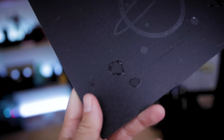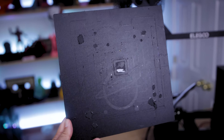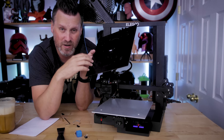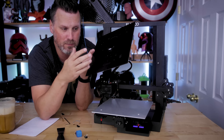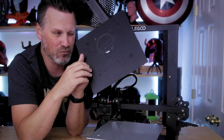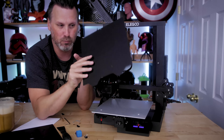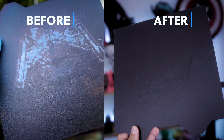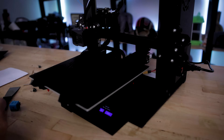Let me get some close-ups so you can see the build plate — it is looking really rough. You can see where the peel basically came up with the filament during the test prints. It's dug into a number of areas and just completely peeled up in certain areas. I'm not sure if it's just a reaction to the Elegoo build plate surface, but clearly this is not sticking and staying on there. So I'm going to power through and try it out on the metal build plate that had a coating on top already that was peeling up previously — hopefully this will do better.